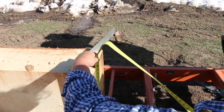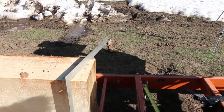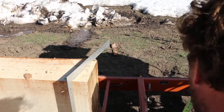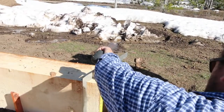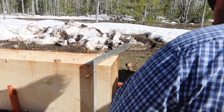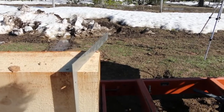So I'm gonna lose some thickness in the blade as it goes through. So I'm probably not gonna get 8 boards, but if I go 2 inches, I might be better if I go 1¾ inches. But I typically, when I'm cutting, like the option of being able to downsize it or remill it or plane it or cut it later. So I like to do everything at 2 inches. So we're gonna go with that.